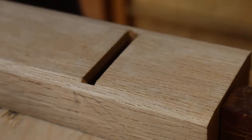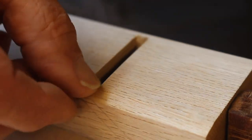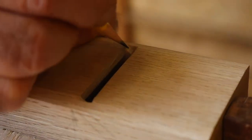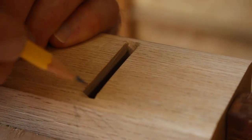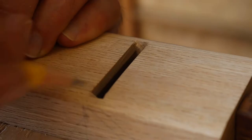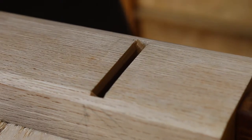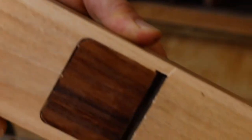One thing I really like to do on these planes — in fact I do it on all my planes — is to put this cut in here. The function of this cut is when the blade is in here, you get little scrunchings, little tears flowing by the side of the plane, and they jam up alongside the blade, especially in the Japanese blade which is tapered back in this area, and they can fill up enough to rub the surface or even stop the blade from cutting. They jam up and it takes either backing the blade out or tediously getting in there with something to get those shavings out. I think you'll see when you're planing with your planes that it fills up.